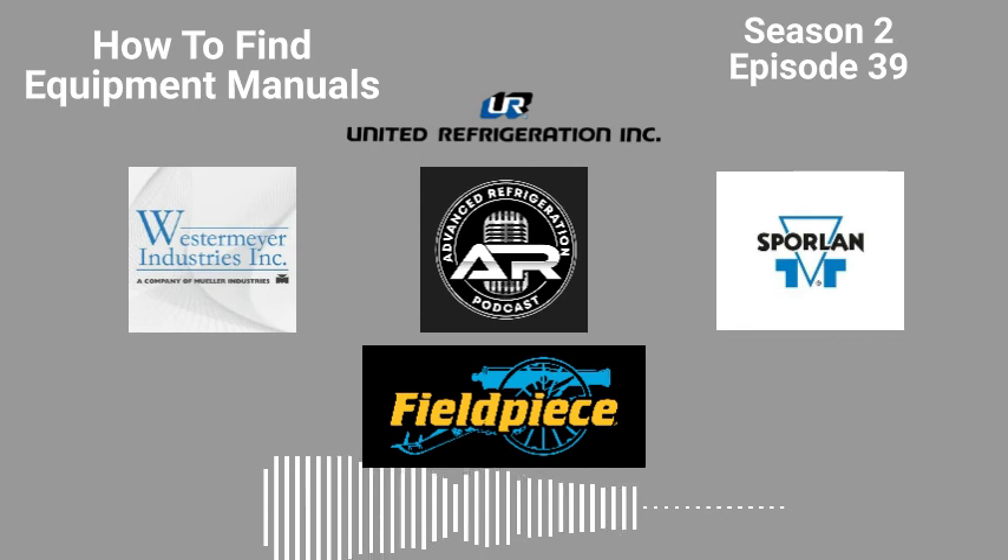The moral of the story is: look these manuals up before you call tech support. Look them up before you call your league guy. Try to find that manual and read through it. If you're working on a piece of equipment you've never worked on before, read the manual before you work on it. If it's a case, look at what the defrost is supposed to be, what the case settings and temp settings are, how the shelves are set up. I see so many guys miss problems because shelves are too long, too short, or in the wrong order. The IOM manual has everything — shelf lengths, shelf setups. Googling that manual is number one key.